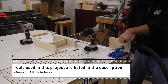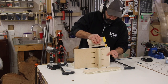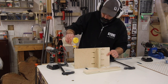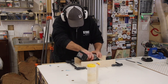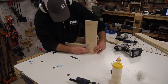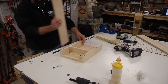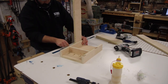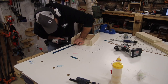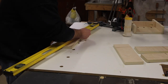After I get all the pieces cut, I go ahead and drill the pocket holes. The first step in this project is to assemble the shelf underneath the chair. I get everything drilled with pocket holes, glue it all together, and assemble it. Then my next step is to go ahead and put the legs on.